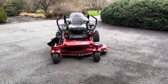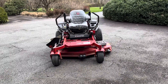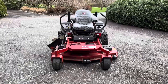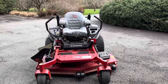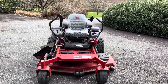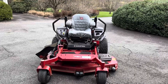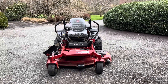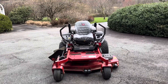If you go through all those steps properly and execute them well, the mower deck will not only leave a flatter, crisper cut, but you're also going to get a further discharge because you're not losing air in random directions, and it should reduce deck blowout as well. Hopefully that was helpful. That's the process I went through to get this Toro to cut the way it does. One thing I've noticed is that more tightly baffled decks tend to be more sensitive to deck level because their total volume is lower, so a big rush of air affects them more than a more open-style deck. Keep that in mind — tightly baffled decks are more sensitive to deck level.